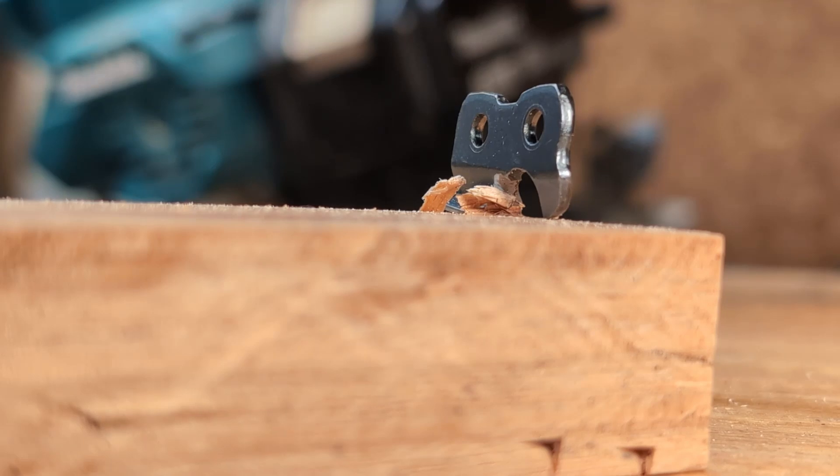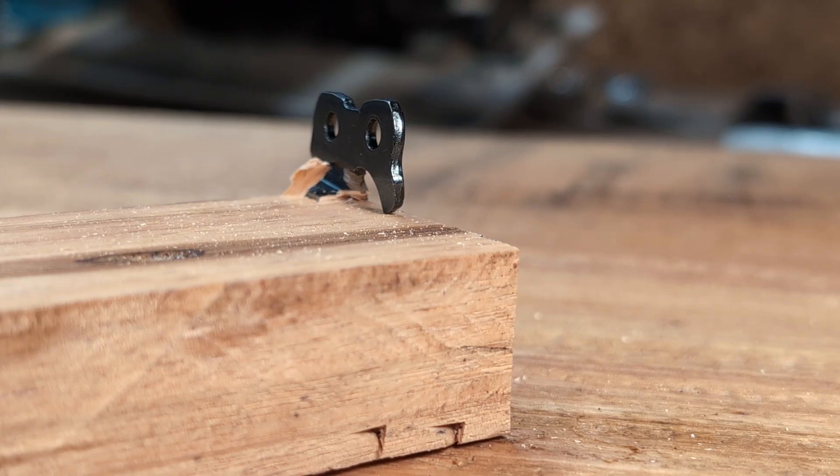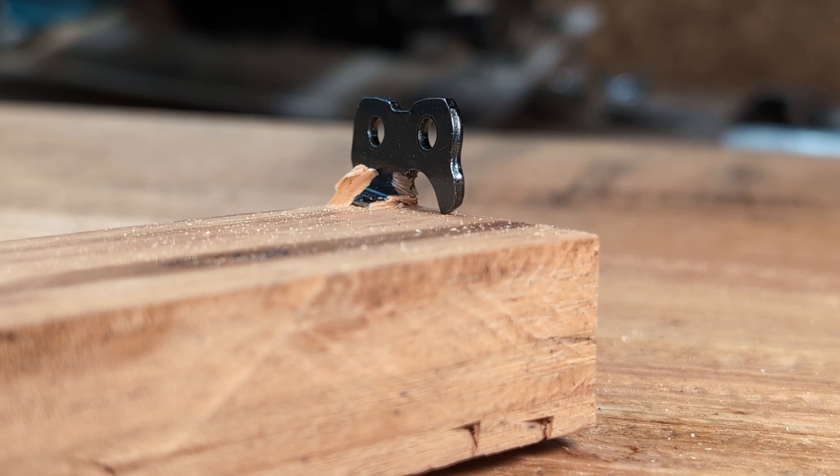I'll throw this in just because it's another shot of it pulling chips. It's now square filed and has more top plate cutting angle - approximately 50 degrees - making it much more efficient at clearing chips. So that pretty much wraps it up. This is just the very basics of how it works - I just wanted to show it in action. It can sound very complex, all this sharpening stuff, but at the end of the day it's pretty basic - we're only dealing with three angles. Hopefully, just seeing it sticking into some wood gives you a basic understanding of how it works, and from there you can build your knowledge on how you might be able to change or modify things to work better for you.